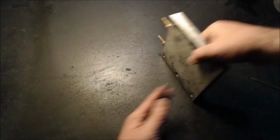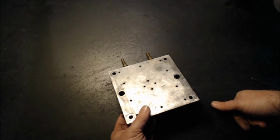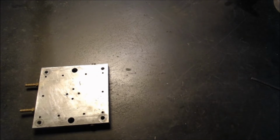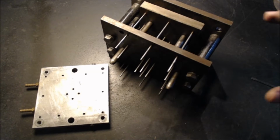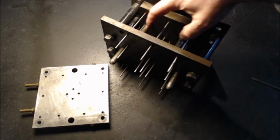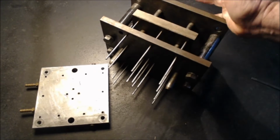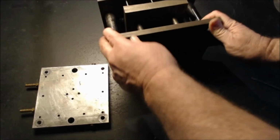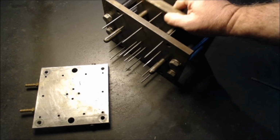okay. The back side of this one is no milling whatsoever, just holes drilled through. But the ejector side has to have a way of punching out the parts. So that brings this piece into play. This piece is made of steel. There are 1/2 inch supports in the center. This piece can slide back and forth on there. There's a pin that comes in here and bolts to this, and it'll activate and knock the parts out.